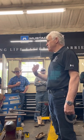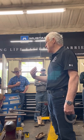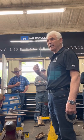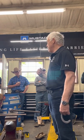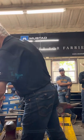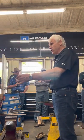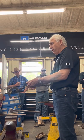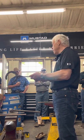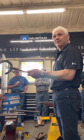If you don't have good fitting tongs, the first thing you do, you grip the shoes in inappropriate places, you grip too tight, and you lose any finesse that you might have. So I'm very fussy that I have tongs that fit. Okay, I like a parallel grip on the top of the shoe. I like a parallel grip on my tongs. That way, I don't need to grip very tight, okay?